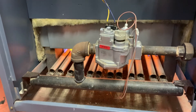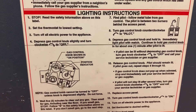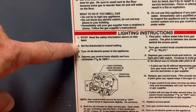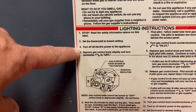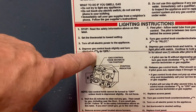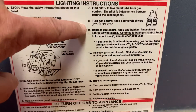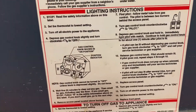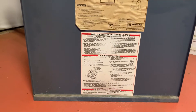That's how you light the pilot. This is for educational purposes only — do not try this at home following my directions. You need to follow the pilot lighting instructions on the inside front cover. Number one: stop, read the safety information on this label. Two: set the thermostat to the lowest setting. Three: turn off all electric power to the appliance. Four: depress the gas control knob slightly and turn clockwise to off. Then follow steps five through fifteen specifically and you'll be fine. If it doesn't light, call a fully licensed or qualified heating professional. Thanks for watching.